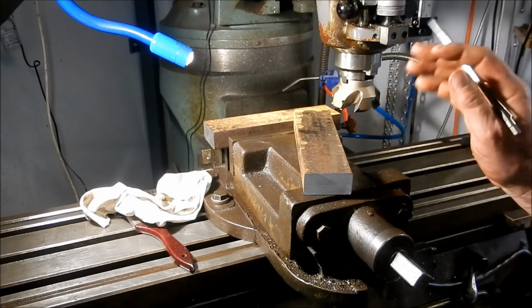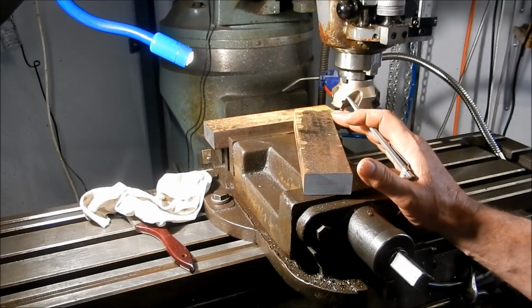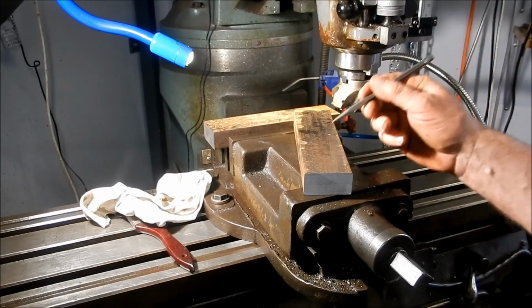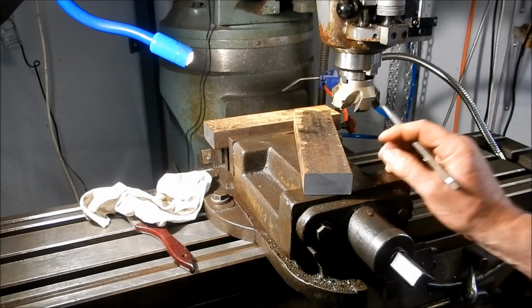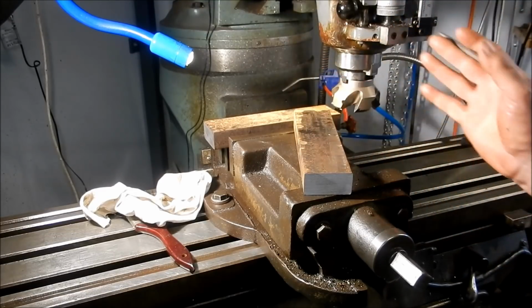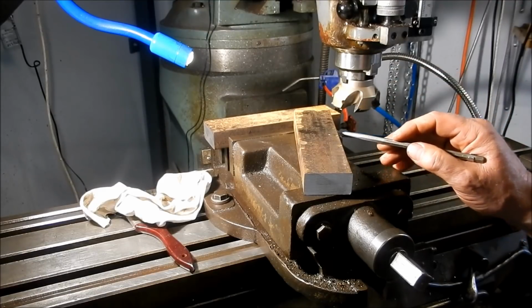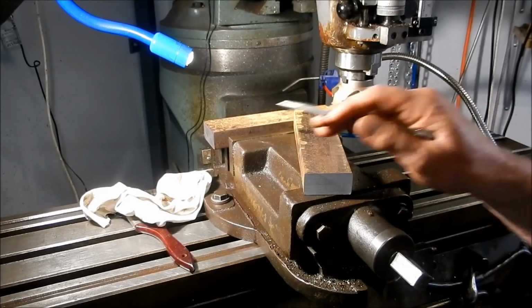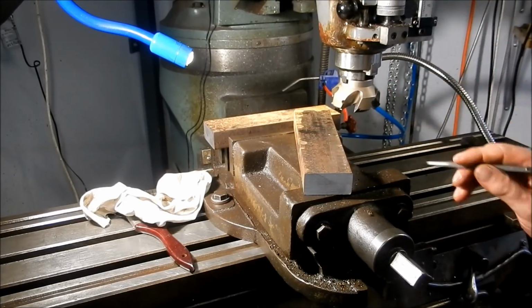When that does happen, you need to set your machining sequences up in a way that you're going to work with that movement and try and take it out. You'll try and even the amount of machining you're doing around on each side, lifting up, turning over, remachining. If you've got the bow in it, often you'll pack underneath it, machine it flat on the top again, flip it over, try and take the bow out.